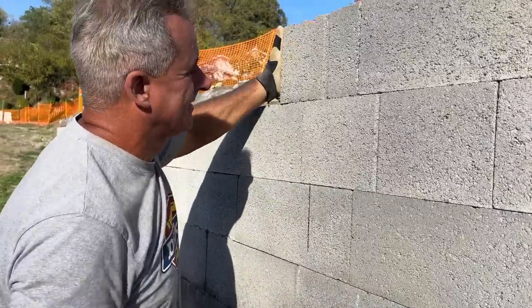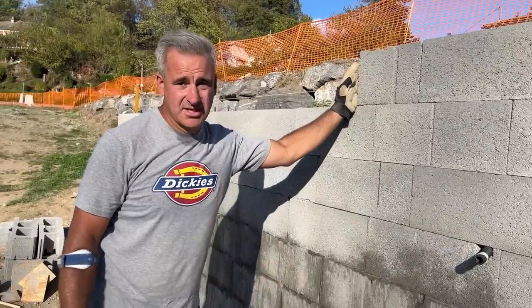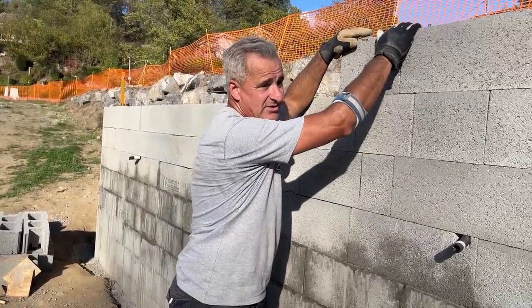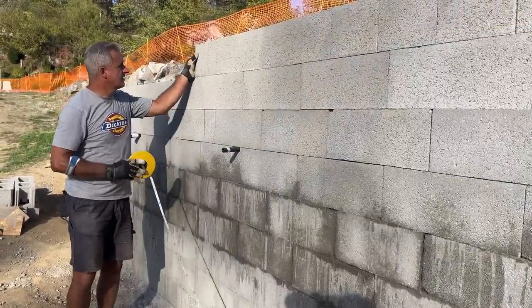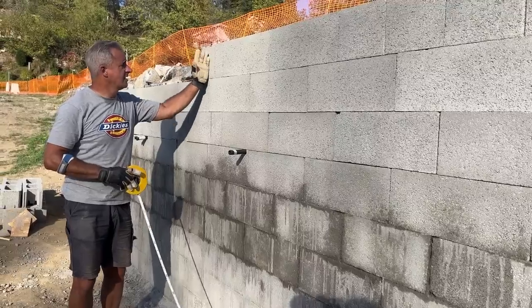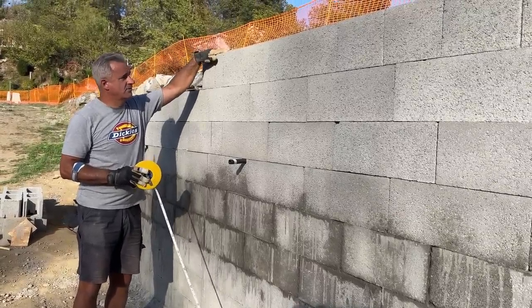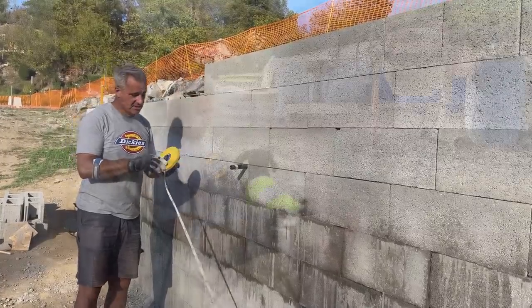Yeah. Wow. So that is the edge of our garage. The garage steel work will sit on top of this. 10.2 to the end, and we need 10.1, which is there, but I just want a little bit of flat bit in front of the pad where the steel structure is going to start. I don't want it starting right on the edge.